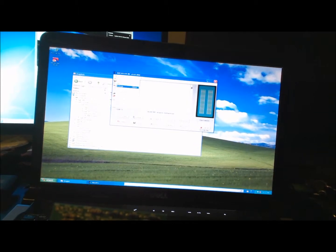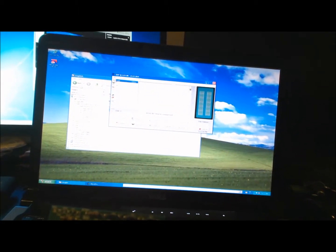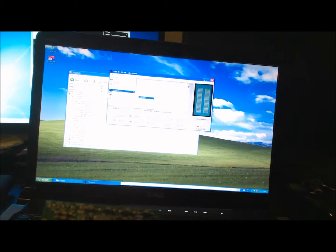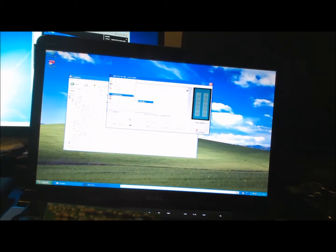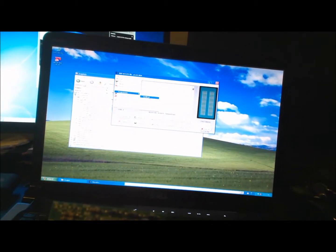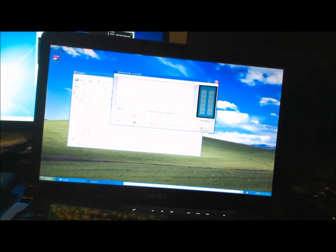So under file and port, that's where we set it to port 3, and then file and then programmer. Select the programmer that you are using. So I'm selecting K149_BC, but you'll need to change it to K150 if you've bought a 150 or 149 depending on what you've got.